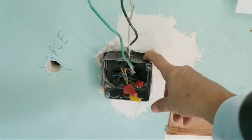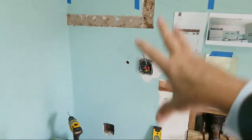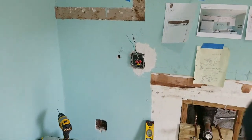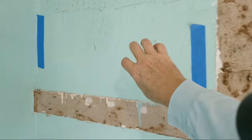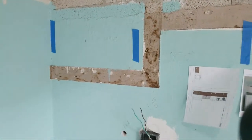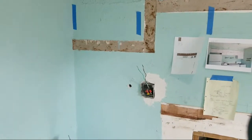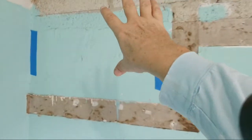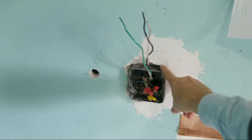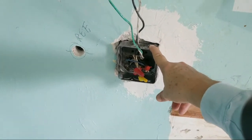We got the refrigerator circuit done. A bit of warning: when you buy refrigerators these last few years, they don't give you the long cables anymore like they used to. If you pulled out an old refrigerator and the cable reached up high, you're going to be disappointed when you push in the new one and the cord doesn't reach. So in your remodeling you're most likely going to have to lower that refrigerator outlet. Luckily they already had it lower here.